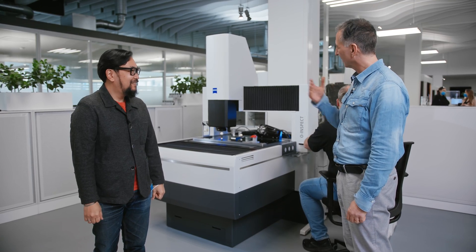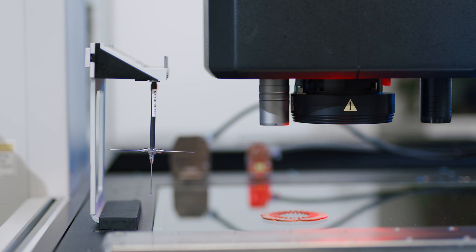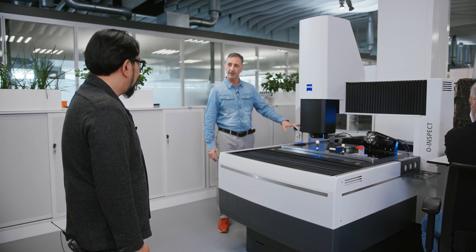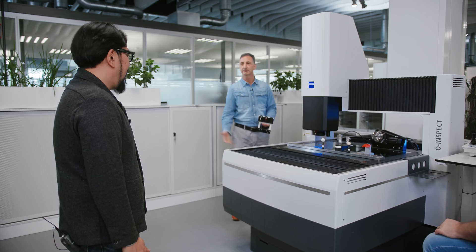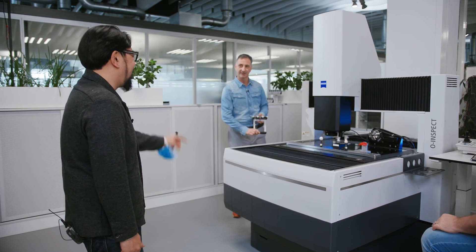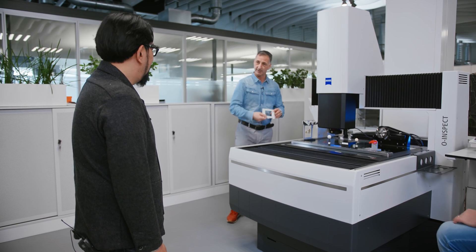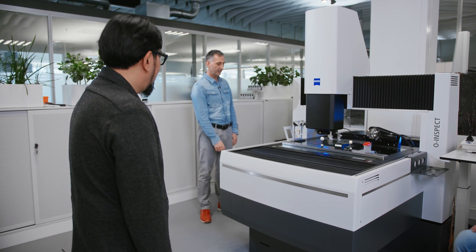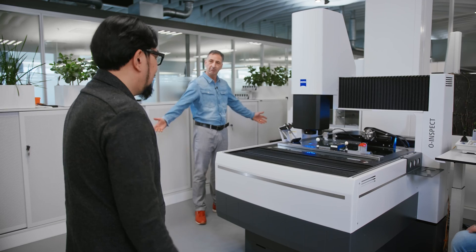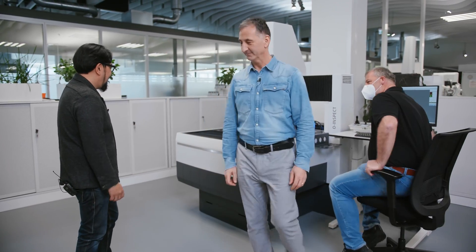We have a lot of things to show, but I think the coolest and easiest is the problem with the multi-sensor rack. If you have it on your frame and drive in the X-minus position, it falls down — that could be very frustrating and cost a lot of money. The solution: place a sheet metal piece here, drive back to the X-minus position, and you're safe. That's a great little hack — definitely saves a lot of money and frustration.